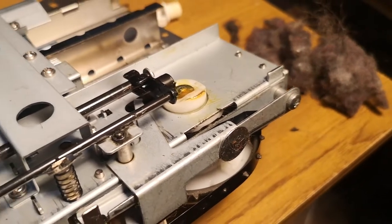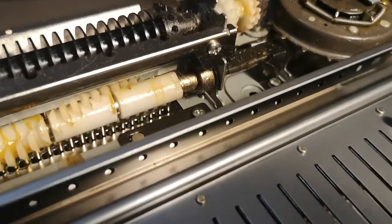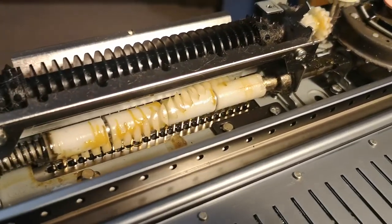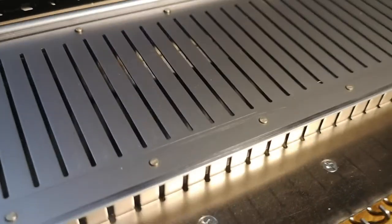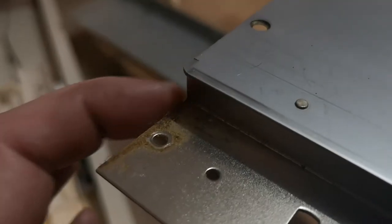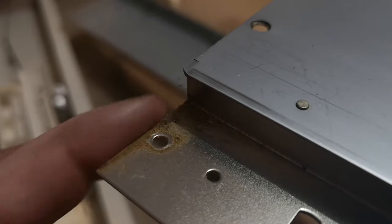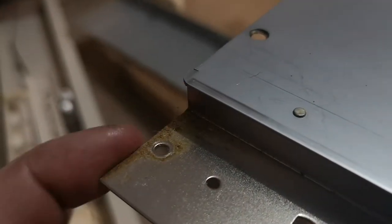You can follow some of my videos showing you exactly how to pull your machine to pieces. And look at all this orange gunky grime here — this all needs cleaning out. The bed did not look too bad — it's quite a nice machine, this chunky. I've got a bit of rust to clean off here that I will use some plastic scouring pads with and some oil — that will come up beautifully.